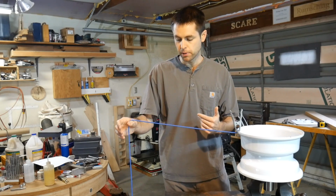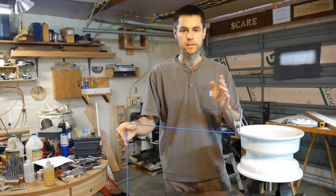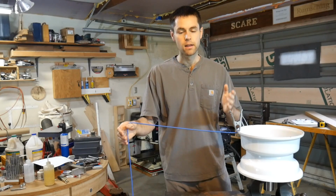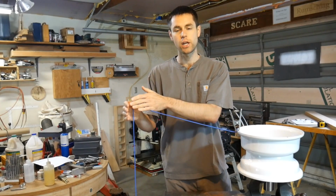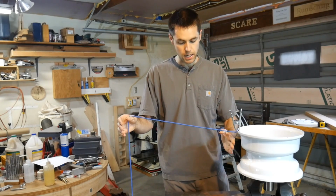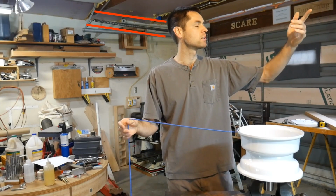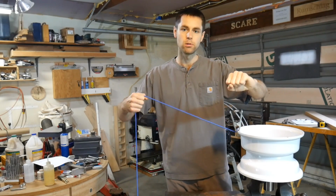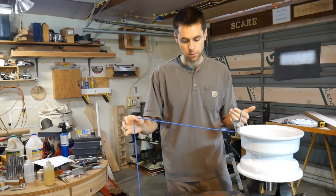So you're going to need a spring which has 10 inches of travel. I'm ballparking 10 inches as the travel right now. Unless that spring is very long, your force is going to change quite dramatically over that length of travel. You have to contain that spring somewhere. If you've ever seen garage springs, which are long and have a lot of travel, they tend to creak and rotate a little bit and make noise, which then translates through the whole thing.